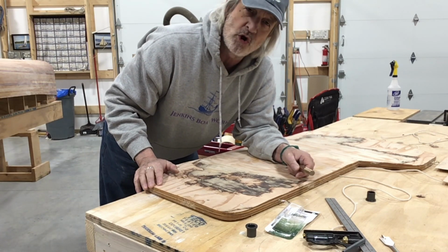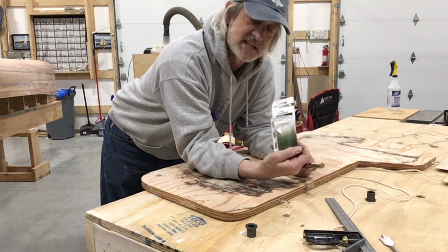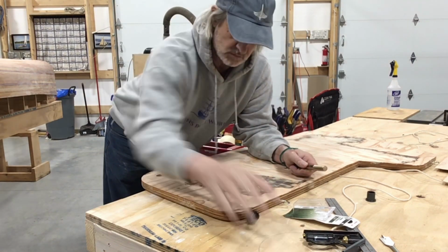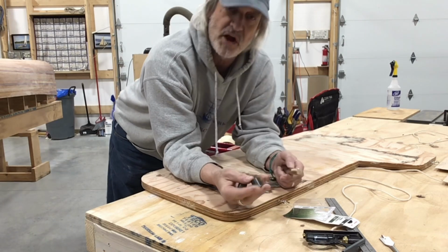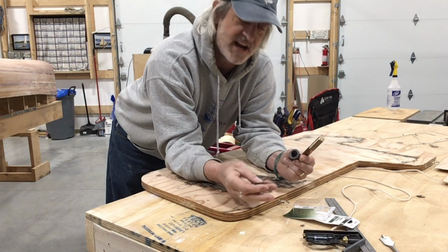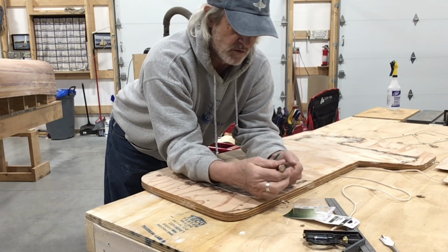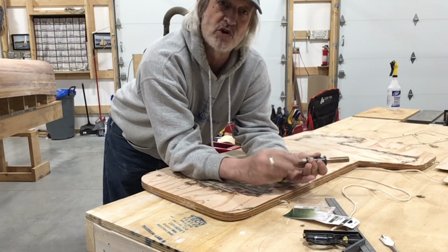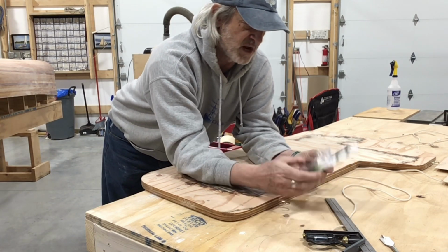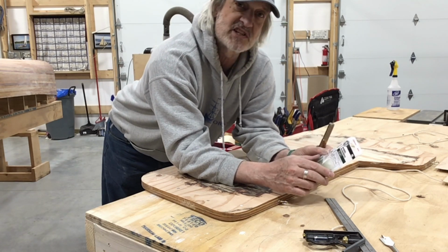And that would probably work, but for $4.99, I got these wheel bushings for a lawnmower that are these dudes. Whoa. And there's 2 of them. I thought, well, I only need one, and I could get away with one, but since they got these little flanges on the outside, see, look how they fit on here. Just perfect. We wouldn't have any binding up. It spins real good on there. They fit just great. And then it tells me here on this, inside diameter 5/8, outside diameter 13/16.